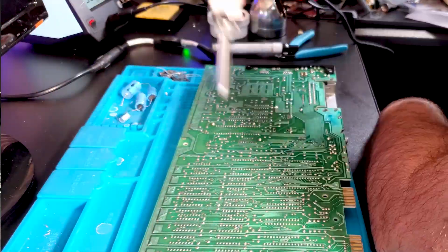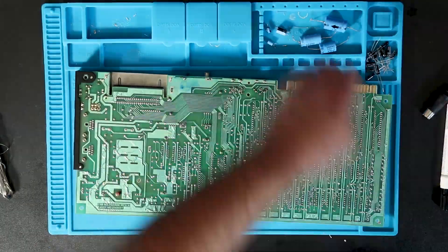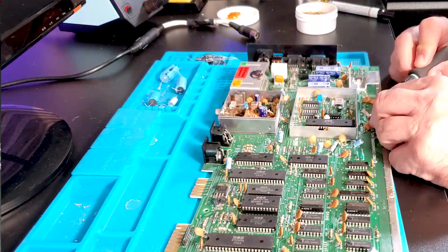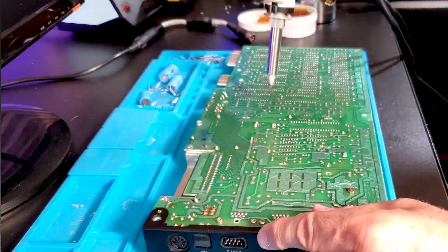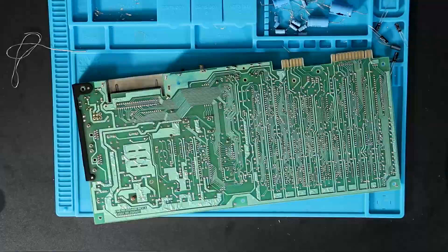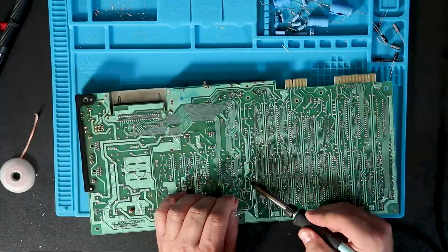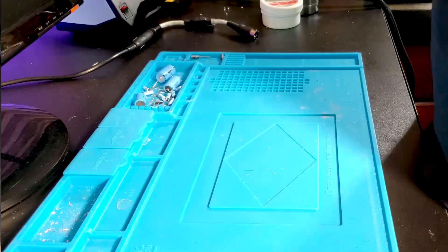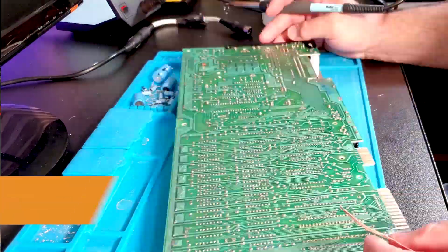I found an interesting study from the University of Sheffield on electrolytic capacitor aging — I'll put a link in the description below. The TLDR was that as a capacitor ages and the electrolyte dries, the ESR will increase regardless of whether the cap is used or just stored. The increase in capacitance seen in aging is reduced when the capacitor is in use, because the aluminum oxide layer on the anode can be reinforced by the current. Interestingly, this implies that a new old stock cap may be worse than one that's been in use. The study also verified that the rule that each 10-degree increase in operating temperature will halve the life of a capacitor is in fact reasonably accurate.